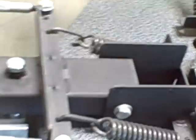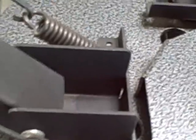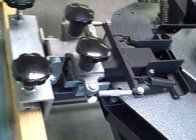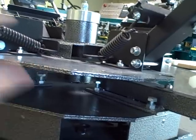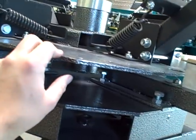This print head is designed for heavy duty work. We've got very responsive springs — a pair on each print head. If you want to do some big printing and put huge screens on, notice there's an extra set of holes in the back. You can add a second set of springs for oversized sign printing. The center wheel on this machine is actually two heavy plates of steel that are welded together. They're perfectly flat, very rigid — no wimpy stuff here.